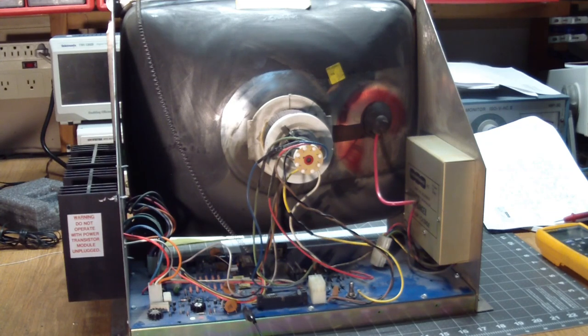Last time we fixed the power supply, which was missing the 5 volts. We tested it in the cabinet and it looked like the game was playing blind. What that means is you can hear sounds in response to button presses, but nothing showed up on the TV. Well, on the vector monitor, I should say.